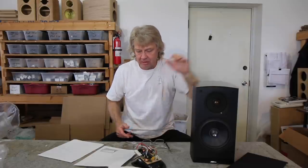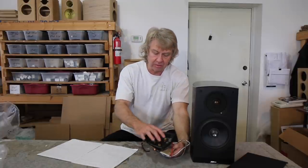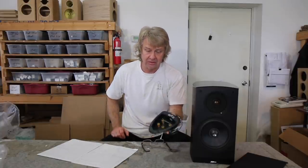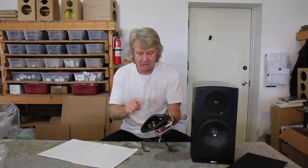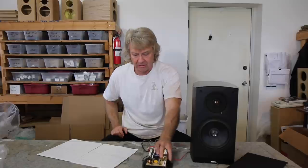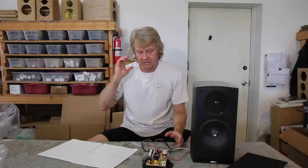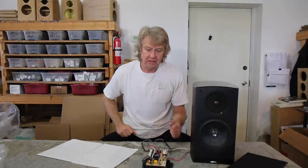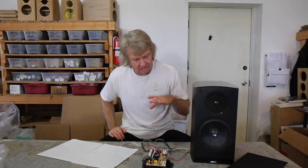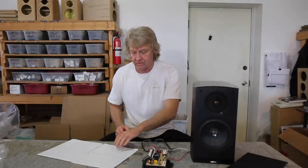All that's going to come in the kit. I put a little parts package together: it's got one set of tube connectors that will replace one of these sets of binding posts. You can parallel the old binding posts so you can use either or, but you really need to get these out of the signal path. So: tube connectors, all new wiring, good quality parts, sonic caps on the tweeter circuit, RC poly caps on the woofer circuit, large gauge air core inductors on everything, and good quality resistors.